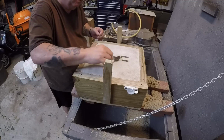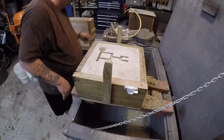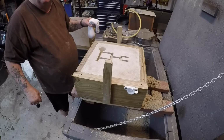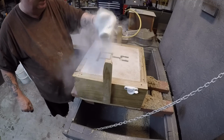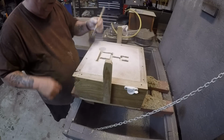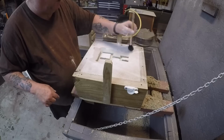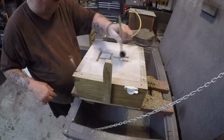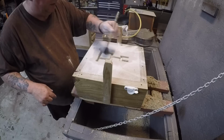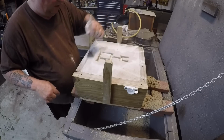Okay, now the rest of it, give it a little bit of a nice touch, and now I'm going to, like you machinists do, get rid of the sharp edges, and the easiest way to do that is with a very, very soft brush. And brush towards the mass of the sand. Don't brush towards the mold cavity, because if there's anything loose that you didn't see before, you'll be brushing all of that into the mold cavity.